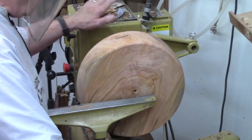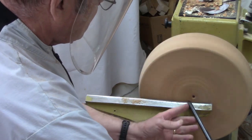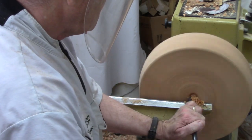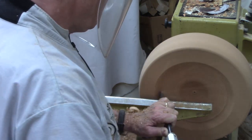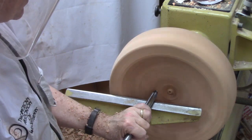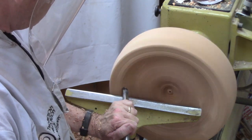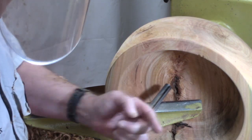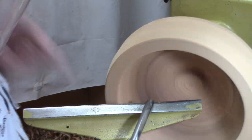I'm going to move the headstock down toward the tailstock for a more ergonomic stance. Bring it in — start with the bevel at almost 90 degrees, handle out at 45, start to cut. I sharpened my 5/8 inch bowl gouge; with a 13 inch bowl like this I need a little more meat from the 5/8 rather than the half inch. I'll have a link up to my video on the bottom feeder bowl gouge — how to sharpen one — and we'll get back at it now that it's been sharpened.